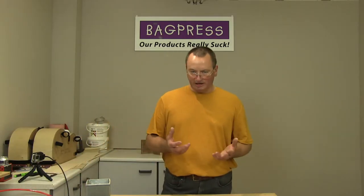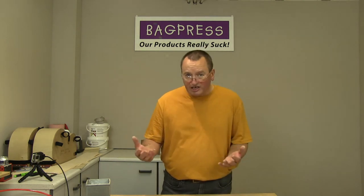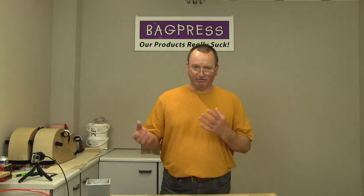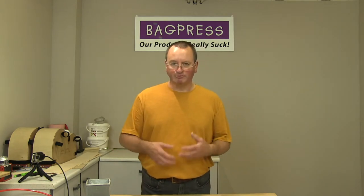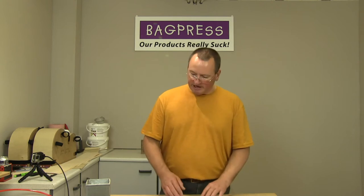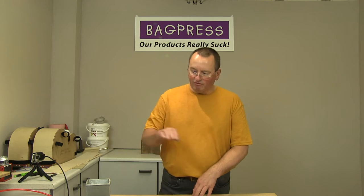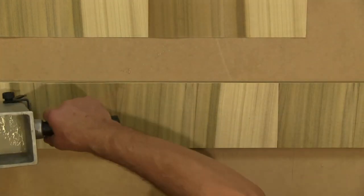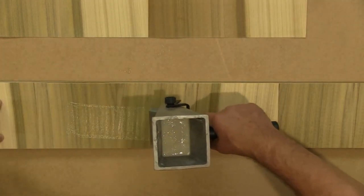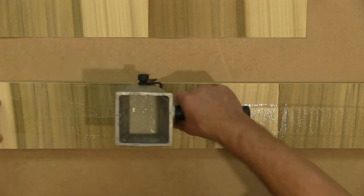And that's always slightly hazardous, because if you go too fast, or if your glue is particularly sticky, I know that sounds odd, but UF resin thickens up with age. So if you're using it near its use by date, it will be more viscous than when you first buy it. There is a danger that the cross grain layer tends to pick up and wrap itself around the roller. So what I'll normally do is I'll put the glue down by pulling it rather than pushing it, because that helps overcome that problem.